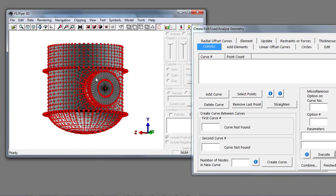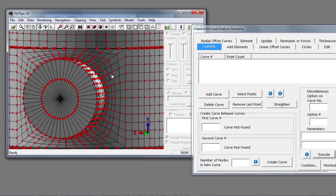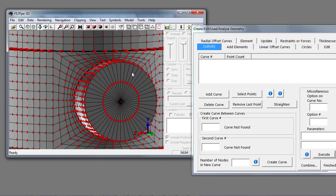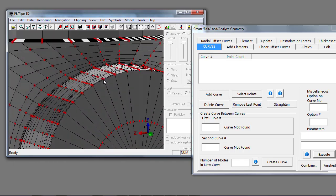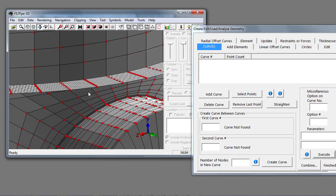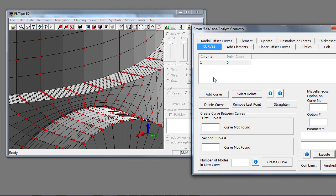The basic fundamental building component in the 3D editor is the curve. The approach we're going to take is to create a curve around the annular plate, down the cylindrical shell, and along the first set of axial elements. You have some flexibility on how you pick off the nodes — select add curve element and as you hover above these nodes you can select them and put them in a curve.